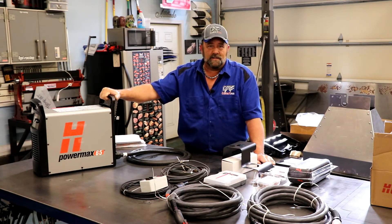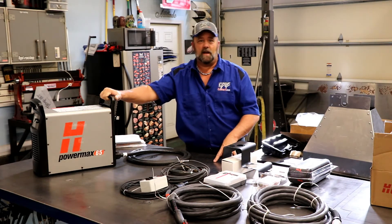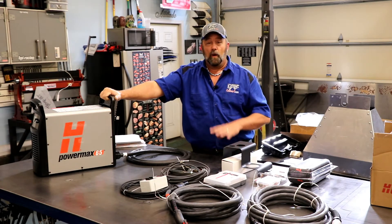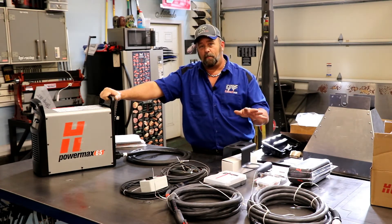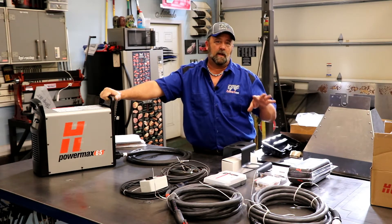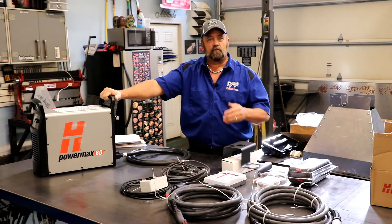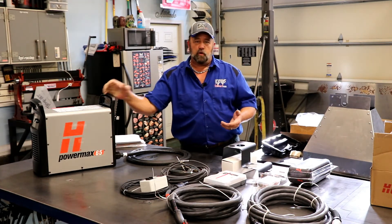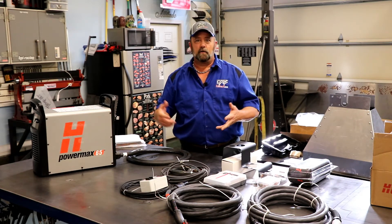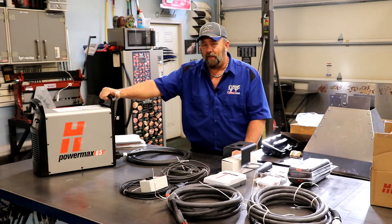Really for what I do in my shop, this is probably a little bit of overkill. I could have done the work with Hypertherm's 45 XP, which is an incredible system. It actually has one capability that this machine will not do — it can turn the power all the way down to 10, which allows you to score the metal. So you could actually score part numbers, names, lot numbers, anything you wanted with that particular machine. This machine won't go down that low.